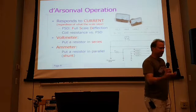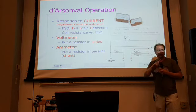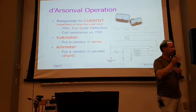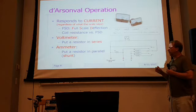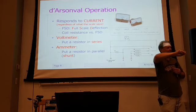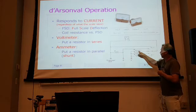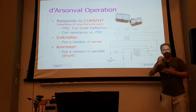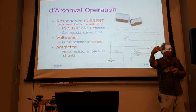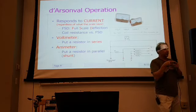So what's ohms per volt? You see that on the analog meter movements. What does that mean? Well, remember, we're putting these resistors in series with that meter to create some full-scale voltage. I want a 100-volt scale, a 25-volt scale, a 50-volt scale, things like that. So if I had a meter that was rated at 20,000 ohms per volt, and I set it on a 10-volt scale, that basically means the resistance through the multiplier resistor and the meter is going to be 10 times that 20,000 ohms per volt. That tells you essentially how much resistance that meter is going to present to your circuit when you connect it up.